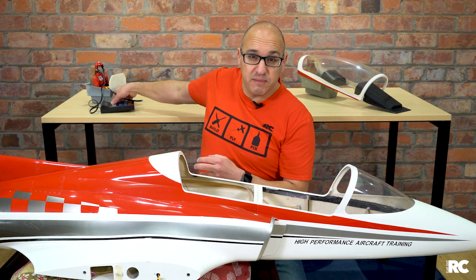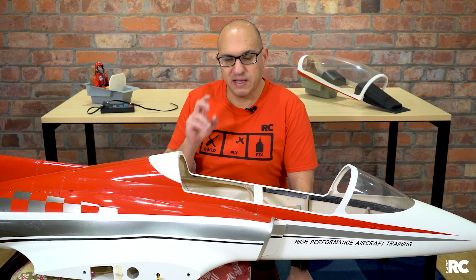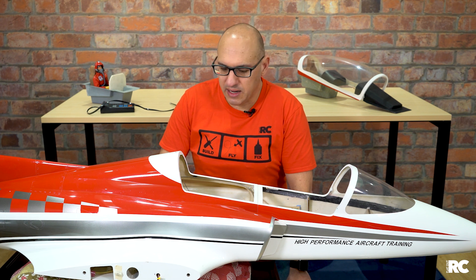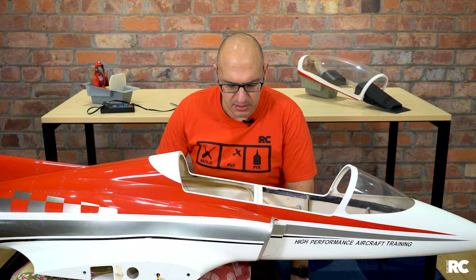It's the same calibration system here with the turbine and the ECU. I was a bit daunted about doing it myself, but I read the JetCat manual and it's literally a couple of paragraphs explaining what you need to do. If you go step by step, it is really, really easy — I had no problem. You're setting things like your start sequence and related parameters.